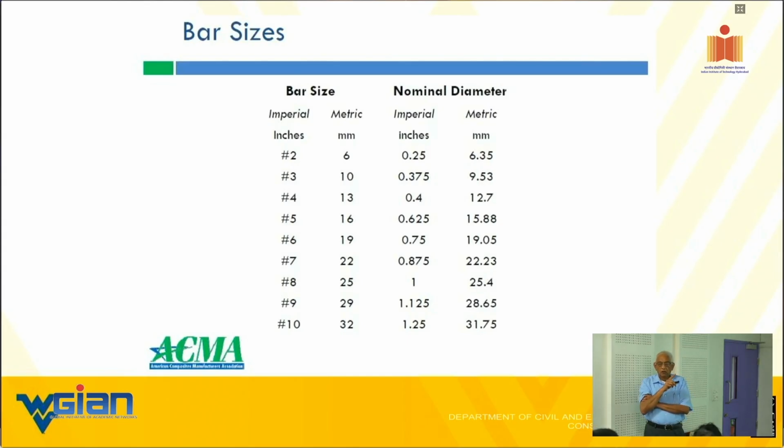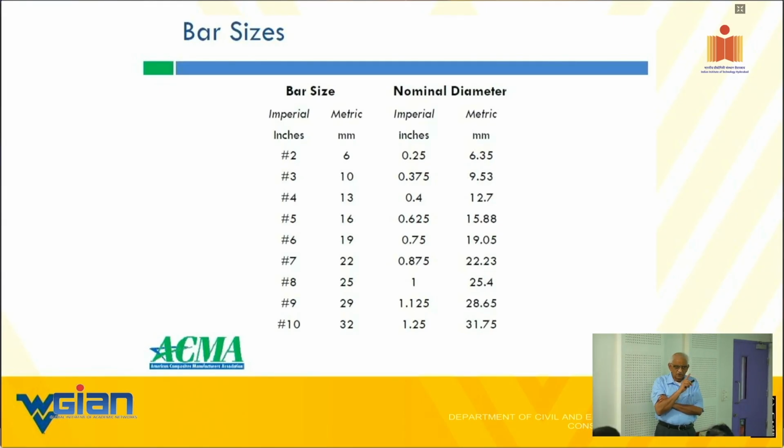Again, one of the major difficulties maybe with FRP is we are not 100% sure how to scale up a product. Whether it is due to shear lag, that's a great example. By now, everybody knows what a shear lag is? So it could be due to shear lag, or inadequacy in curing, or a major worry about creating more voids, and whatever that might be. I can assure you, scaling up may not be as easy as it is in an isotropic material.